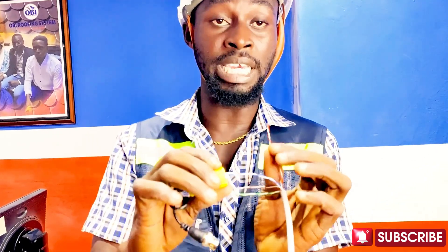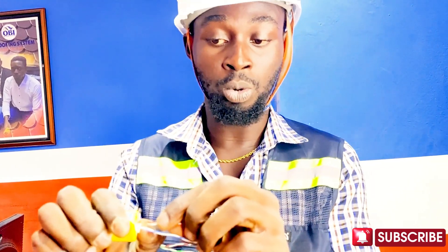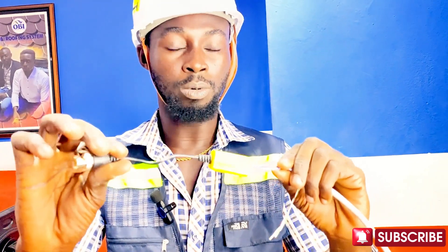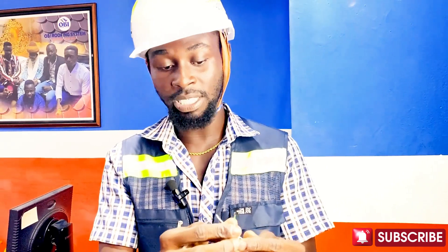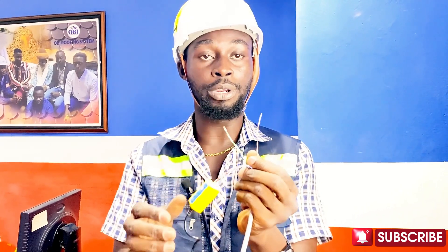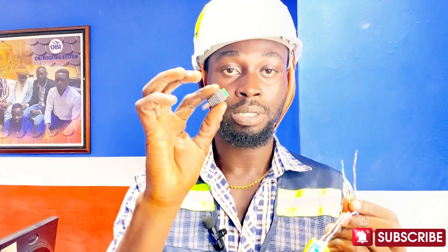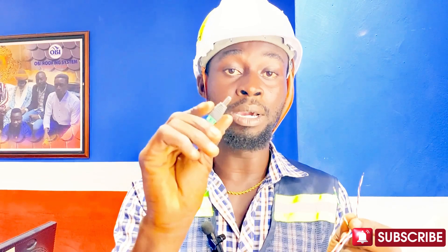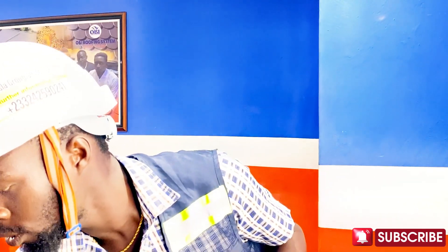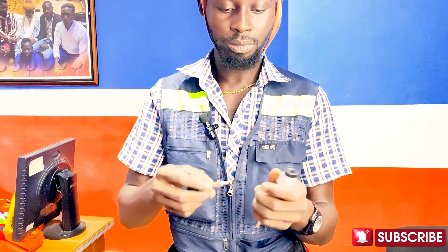A reminder: you can use any wire for any position, but stick to what you choose consistently. I use orange and orange-white for video, and I insert them into the video balun. For the power side, I use brown and brown-white for power positive, and green and green-white for power negative. This is the male type of power pin, and it requires a screwdriver because it uses screws.